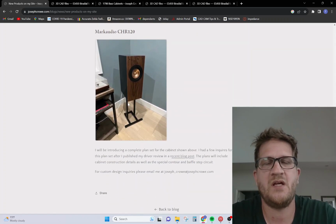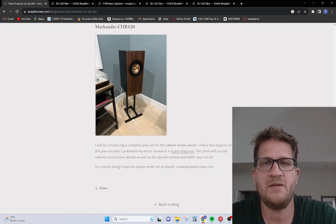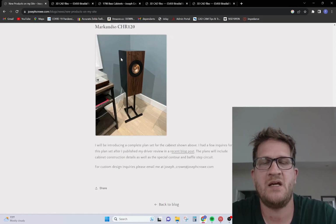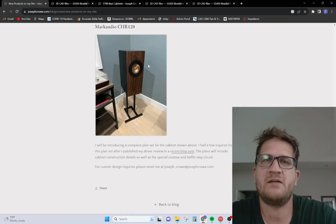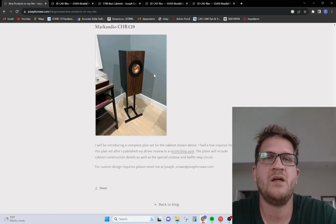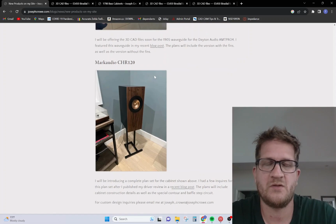Okay, so last for this video is a complete plan set that I've introduced for the Markaudio CHR120. I had featured the driver in a previous blog post, which showed that it did quite well. And so I did get a number of requests for the cabinet that I had used in that testing. I've simply put together a complete plan set that includes the cabinet, the contour circuit, which is a passive crossover that adjusts the overall treble response and improves the sound quality quite a bit from the Markaudio driver. So complete plan set available.